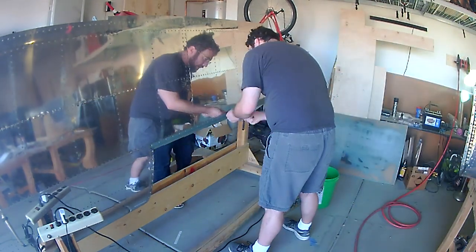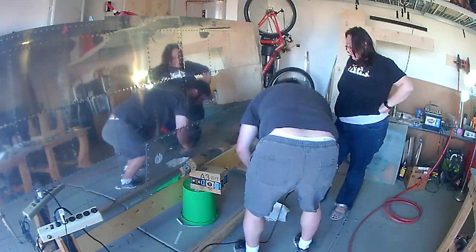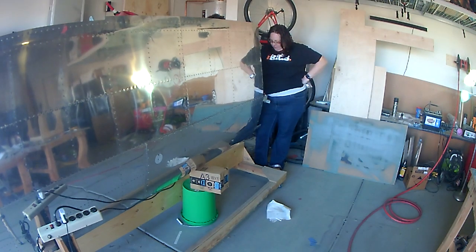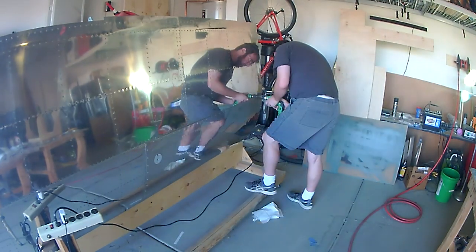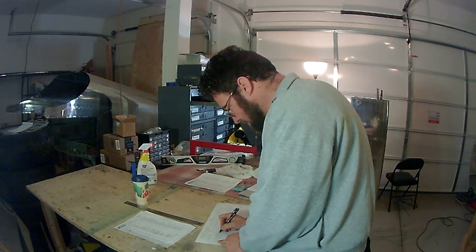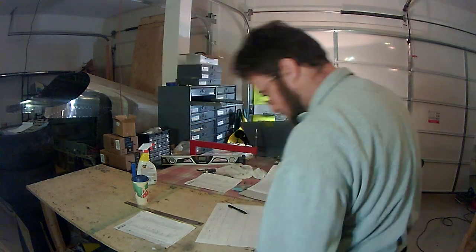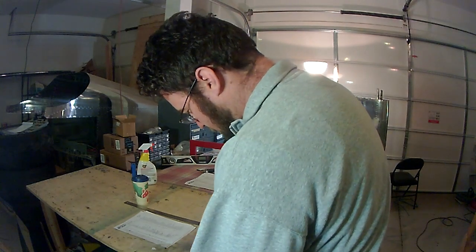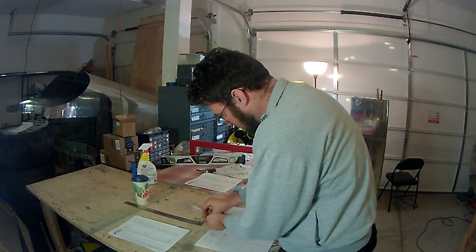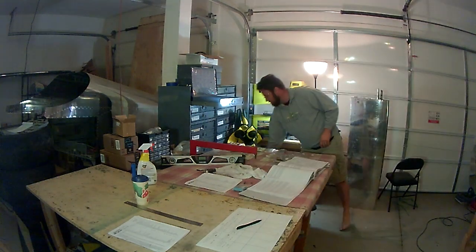To this date, I've assembled the empennage kit — it's about 90% complete. I still have the fairings and some small things to do, things I'll wait on until final assembly such as attaching all of the horizontal stabilizers. I'm mostly complete with the right wing — just about everything is done, it's just a matter of putting it all together. I'm currently working on the bell crank assembly for the aileron. The left wing is prepped, the fuel tank is complete, the leading edge is mostly complete. I think within the next two or three months I should be able to get the left wing complete.